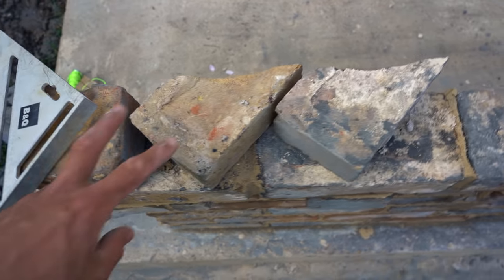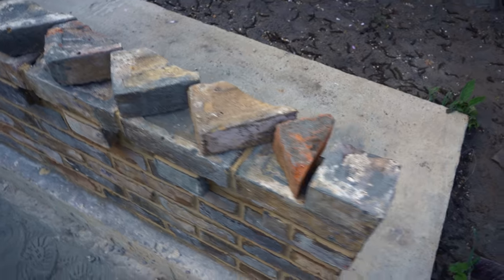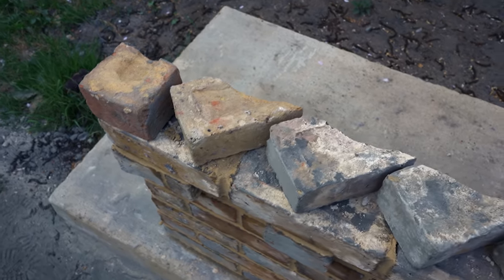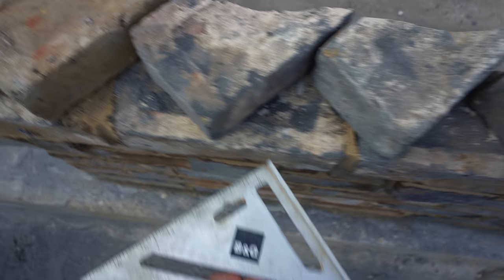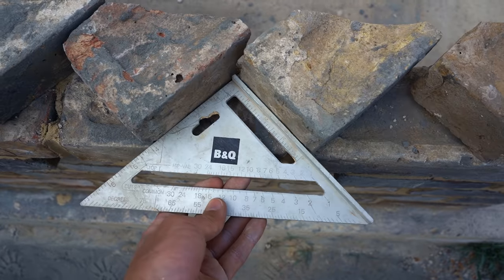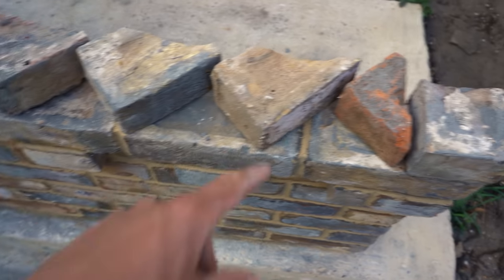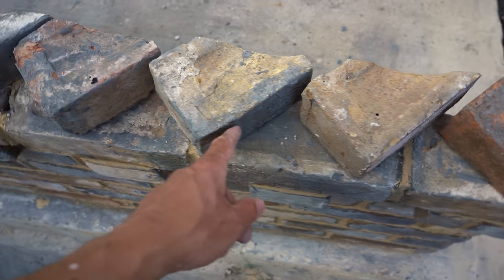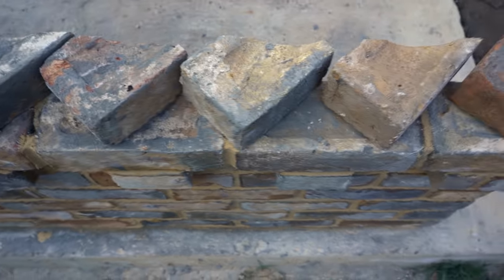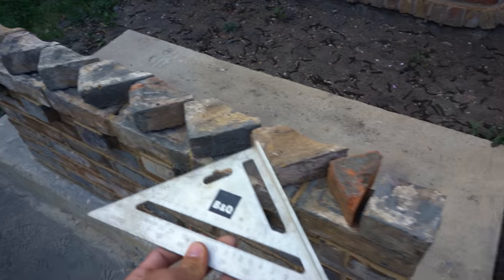Hopefully that has explained how to cut the cuts. I always like to dry lay them all the way through just so I know they fit in perfectly, so I'll come back to you once I've put all these in place and show you what it looks like dry laid. Here we go — this is what it looks like dry laid, ready to go. I like to go along and double check that they're all at a 45-degree angle with either a roofing square or a template. From here I'll take a pencil and mark all of these before I start laying so that we know where we're going, and as you lay them I'd suggest using your roofing square or template to keep that 45 degrees all the way along.